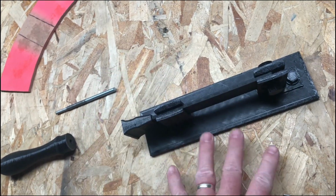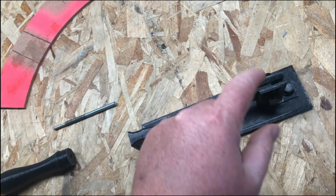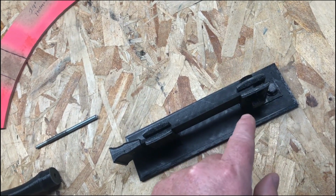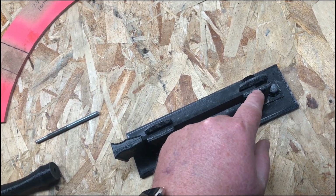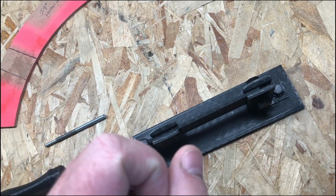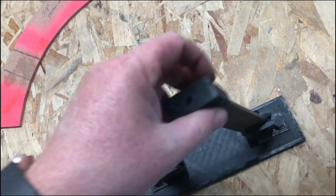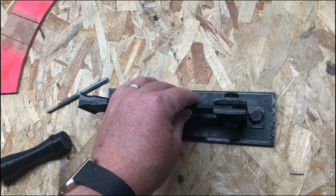Now remember, this is all printed in PETG at 0.15 millimeters. I'm just going to make sure that in the description of the video, and in the PDF of the actual file, we'll have the exact specs for what you need to print this thing at to get these results. My stuff is built very tight tolerance because it's functional. You know, there's movement here, and I want to make sure that everything fits.